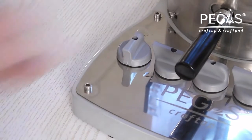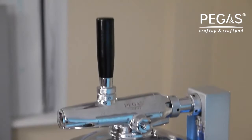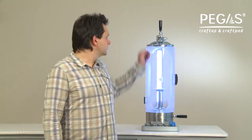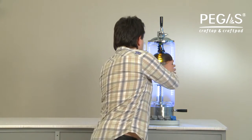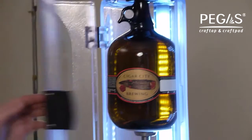Step 9. Turn on the manifold flow control switch for the beer that you want to dispense — the flow control switch is turned anti-clockwise. The flow switch handle should be set in the middle vertical position, which means that the beer and the gas supply channels are closed. Make sure that the valve handle is firmly turned clockwise to the end — this means the pressure release valve is closed. Open the door, set the bottle on the drip tray, turn the bottle fixing mechanism handle to the left, then close the door.